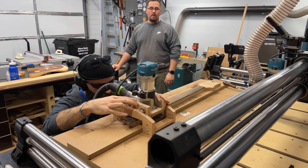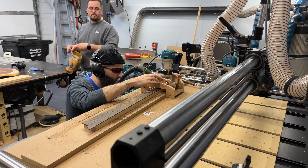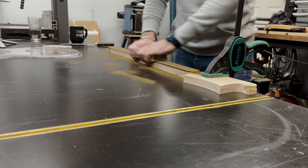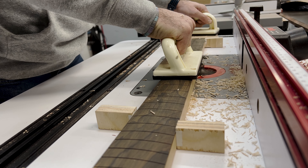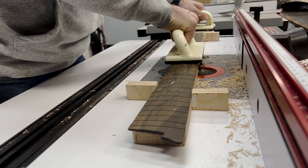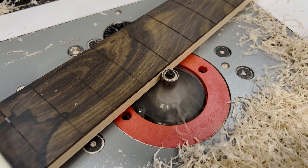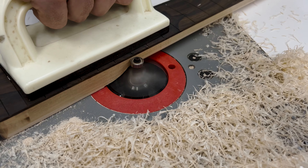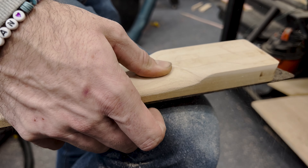Sean eventually took over the radius work while I enjoyed some popcorn — I've been eliminating some belly fat recently, so I needed to completely indulge in a guilt-free snack while Sean finally did some work around here. Luna decided to join us while Sean smoothed out the router marks with a radius sanding block. This zircote may be disgusting, but Sean had a different outlook on what to do with the sawdust. Shaping the neck was easy with a massive table-edge router bit — it has the perfect shape for a guitar neck. We used stop blocks on the neck so the shaping didn't go too far into the headstock or heel. Final shaping was done with a series of rasps, planes, and sandpaper to get a shape comfortable for Sean's fingers.